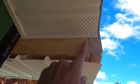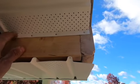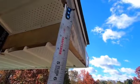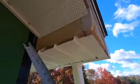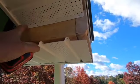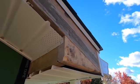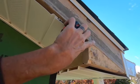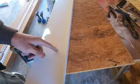Basically I'm going to measure from here to here and make exactly the same distance when I nailed this last piece of soffit on. I bent this down, nailed it on, and made sure it was the same distance across. I'll make one piece of regular fascia — probably about two feet total, about a foot in each direction. I've got 12 inches here and 12 inches out there, so I've got a piece of fascia cut at 24 inches. I'm going to trim one side to this length and let the other side run wild so that when my gable fascia comes down, it'll overlap that and keep rain water running down the fascia.